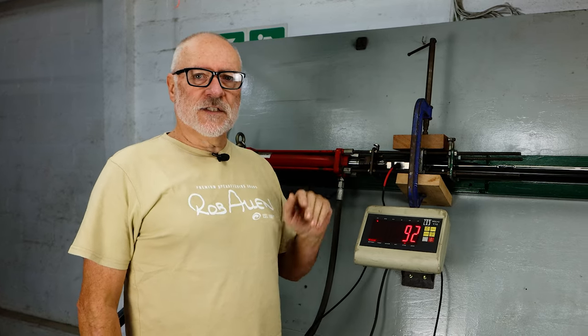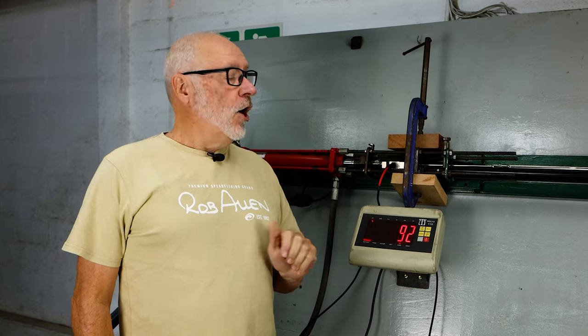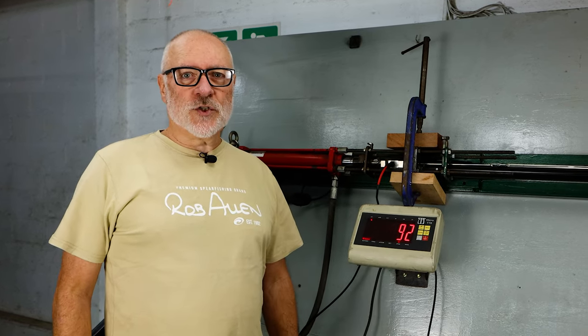In this case we're talking about 0.2 of a millimeter — that's really a small percentage of overall barrel wall thickness. The normal one is about 1.4mm, this one is 1.2mm, so it's 0.2mm difference in actual wall thickness. Hope you enjoyed that video — please feel free to ask questions, and anything else you want us to test, go ahead.